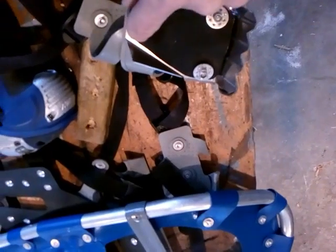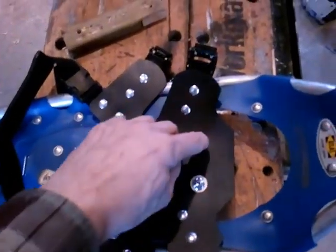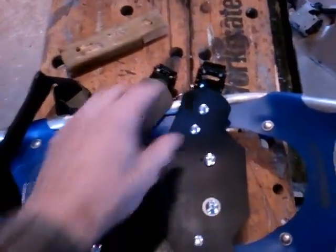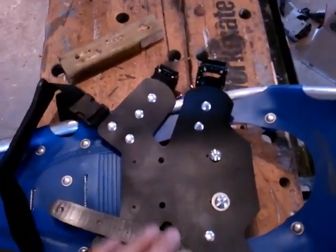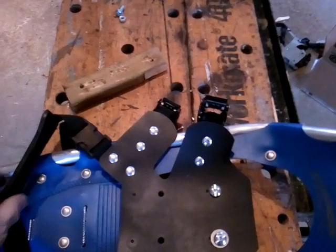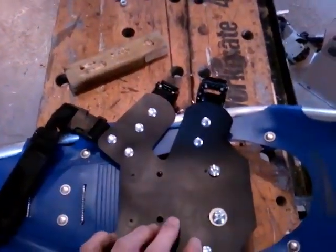I just have to pull out these parts — they just pull through. Then I have to drill out here too. Now I'm putting it together. As you can see, I made a mistake already — I forgot the washer, so there should be a big washer here. This piece goes like this on the top. First time I put it together, I had it the other way around. That's why you keep the other one — always have one already assembled to use as a reference.